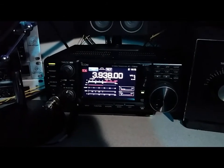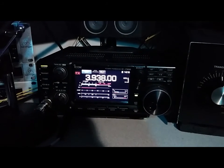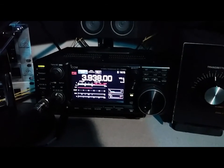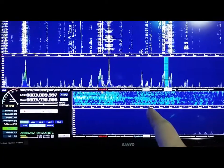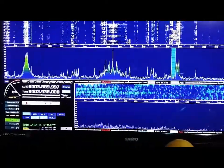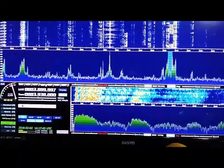The first thing I want to show you is a latency issue. I'm not sure how much of an issue it will be — the worldwide DX contest is coming up and it might matter. It's about a half second of latency between what the radio is hearing and what the software is outputting. The latency comes from USB because the dongle is brought in through the USB port. It has nothing to do with the dongle, radio, or computer — it's just the way USB works.